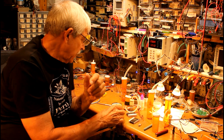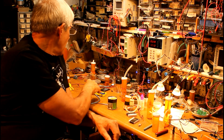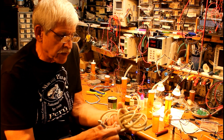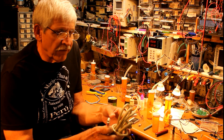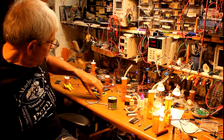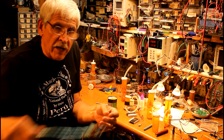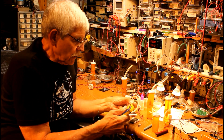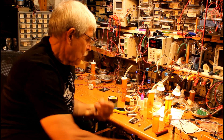Fortunately, these are pretty easy to solder. I would recommend, if you're going to be doing that, that you use thin wire — in the neighborhood of 28-gauge, maybe 30-gauge stranded wire. A good source of that is an old printer cable, and you can find these laying around a lot of people's basements. This is a Centronics printer cable — it's about 10 feet long and it's got inside of it 25 conductors of stranded wire. If you strip off the insulation, you wind up with a nice piece of wire, and if you strip the ends off, tin those ends with a little bit of solder.